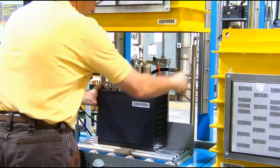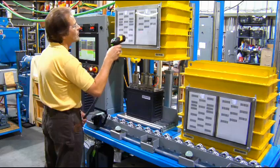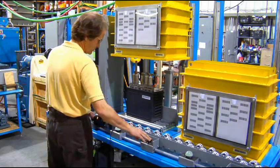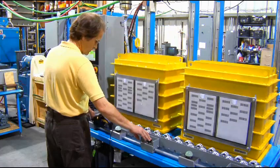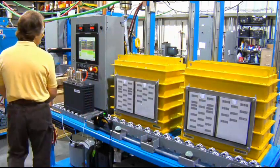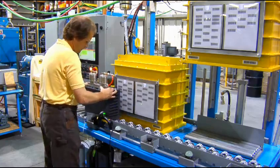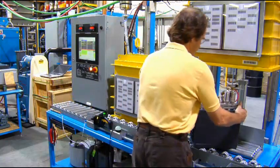This Vacumulation system is leak testing batteries that are charged in chamber with helium. The charge-in-chamber process is critical to testing this product, as the battery case cannot withstand a large differential pressure. Unlike standard hard vac leak test chambers that must be evacuated into the Millitorr range, the vacumulator only needs to pump down to 10 to 100 Torr. Helium is then vacumulated inside the system to allow sufficient signal to detect leakage from the battery case.